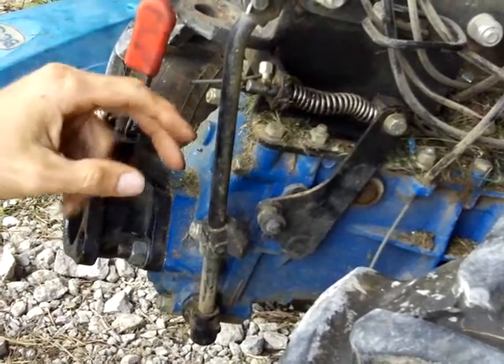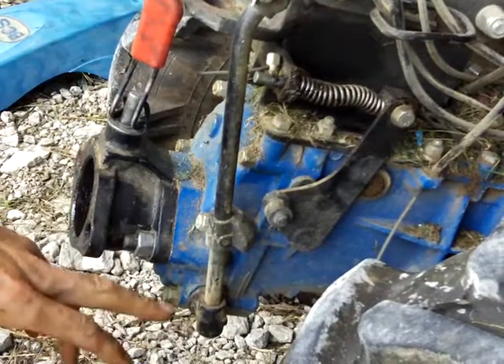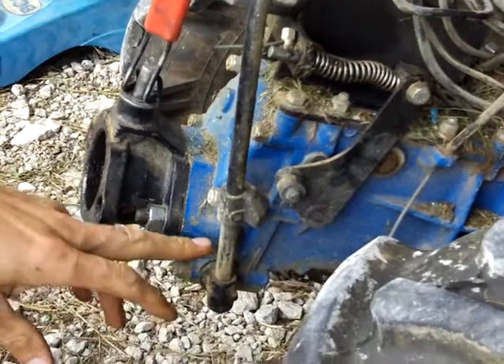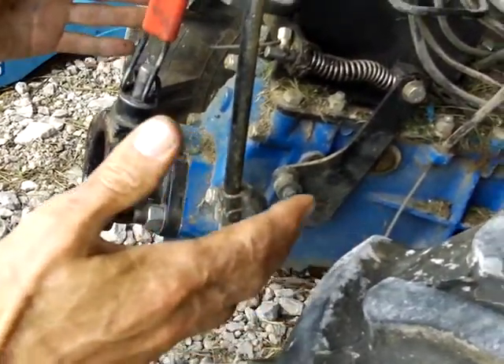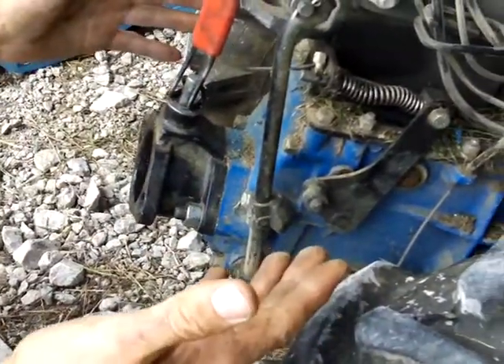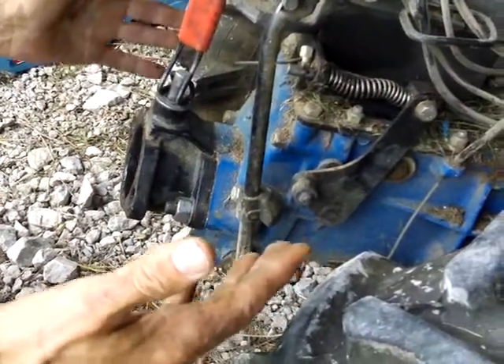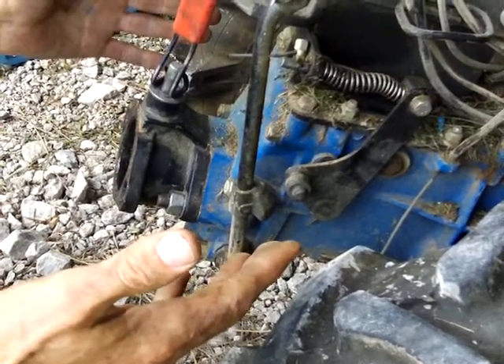The problem arises when this system is compromised by corrosion and/or negligence. What commonly happens is you have your walk-behind tractor for many months or even years with a soil-working implement on it, and one day you decide to switch the handlebars around to the other side, put a mower or snowblower on the thing, and suddenly the PTO won't function.